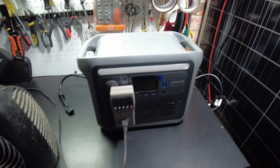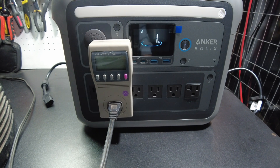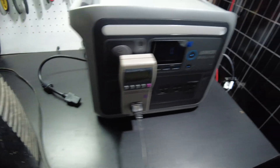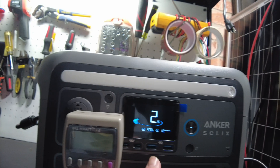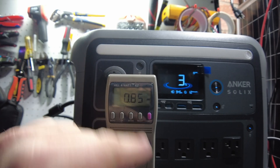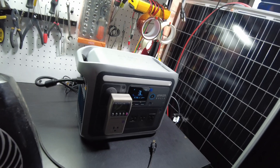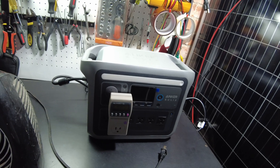So I'll come back when this is complete. The test has completed — the power station is down to 1% and has shut down the AC output. We need to plug the AC charger in to reactivate it. Once it charged up a little, the AC output came back on. We got 0.85 kilowatt hours — so basically 850 watt hours out of 1056. That's pretty reasonable. Going through the inverter there's some efficiency loss, so the usable capacity is 850 watt hours.